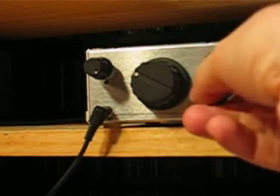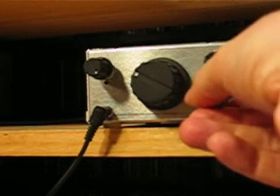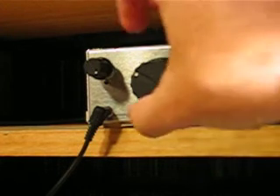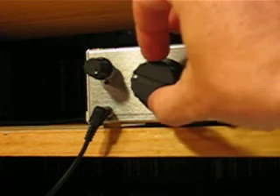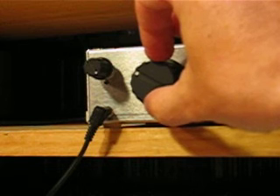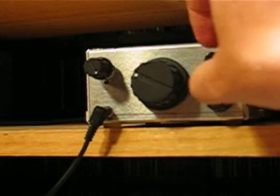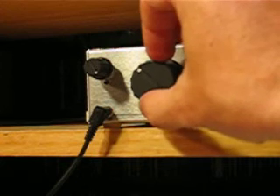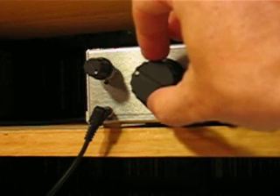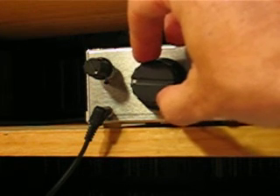What's nice about this 10-turn wire-wound part, it makes it easy just to adjust the regeneration so that it's just on the edge. Listen as I tune through the signal — sounds like quite a narrow filter, doesn't it? And if I back off the regeneration and tune through the signal, it doesn't sound quite as narrow.